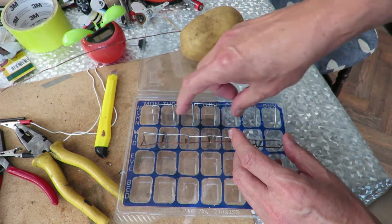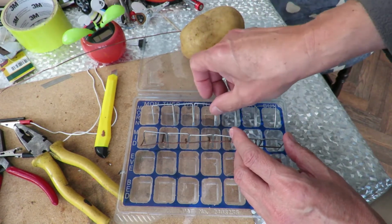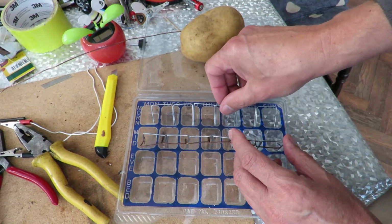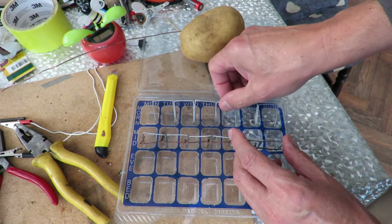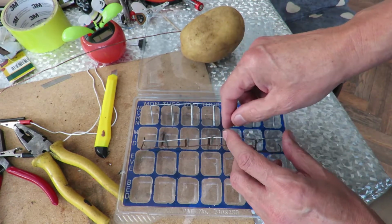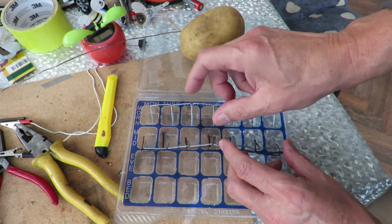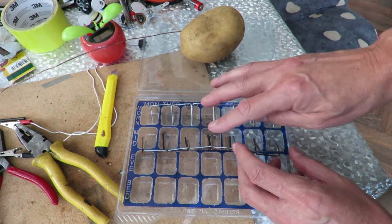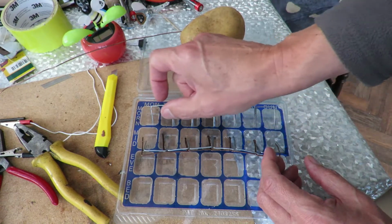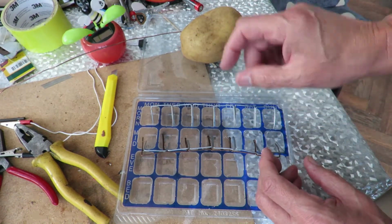So whatever voltage we get from there, which I think is about, from memory, somewhere between half a volt and 0.7 of a volt or something like that. So if we have 2 in series, we should get over 1 volt with a reasonable amount of capacity. I mean, they're only going to be small cubes in there, but that's what I'll do.